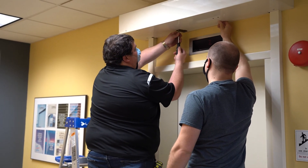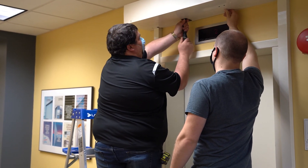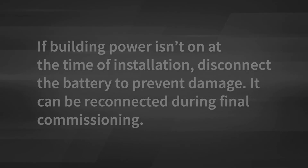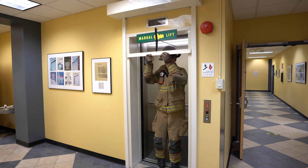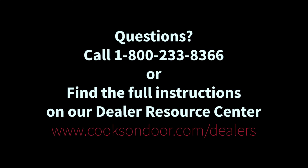Remove the center number 10 hood cover fastener. Ensure that the curtain is in the fully open position. Position the installation clip and fastener in place with the hood cover fastener. Please note that the green button can be pushed to disconnect the battery and the red button can be pushed to trigger the alarm without removing the hood cover. The installation clip must be removed for final operation. Complete the acceptance testing form and retain a copy for your records and supply one copy to the owner's representative. Thank you for watching our step-by-step instructions on how to install the new smoke shield elevator. Full installation instructions can be found on our dealer resource center.